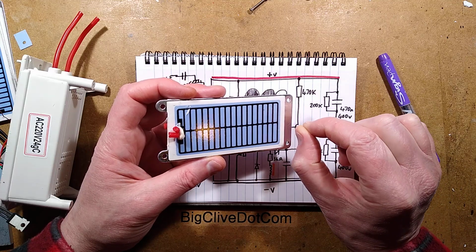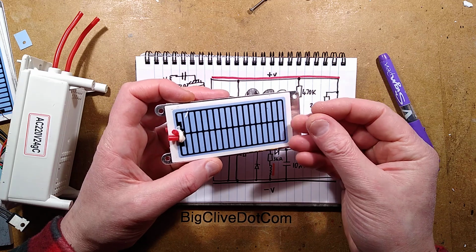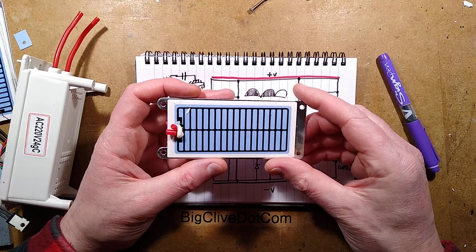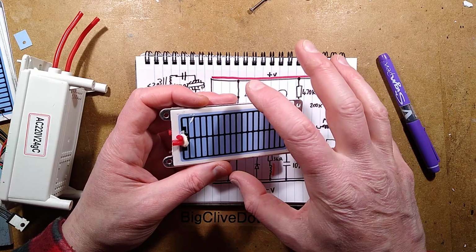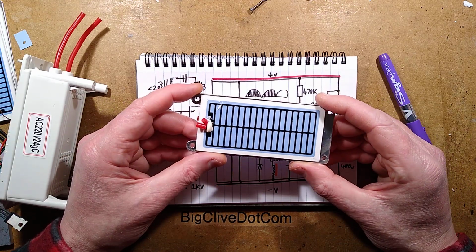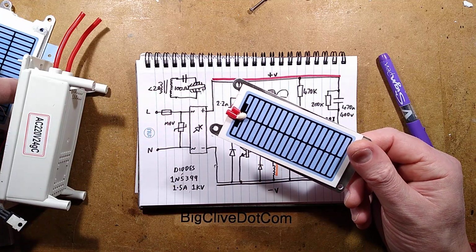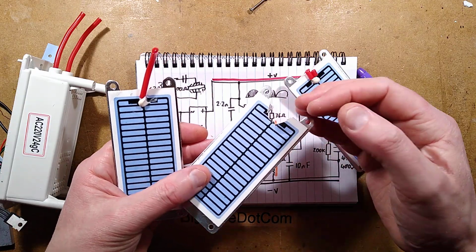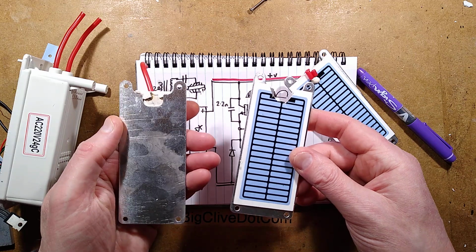You see an orange flame coming out where it broke through, because that spark going through it is heating the glass up to a molten temperature, and it's liberating the sodium from the glass. But then usually, once it's heated up, the thermal stresses cause it to crack from that point. And then you've got a little flaming arc on your hands, which is also a potential failure mode, because I had it with this one when the ceramic was supplied broken, and it just arced straight across with a very, very hot arc, like a sort of igniter arc. But there we go.